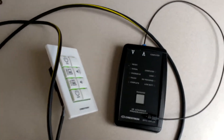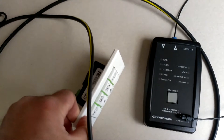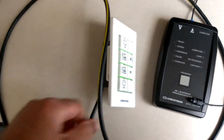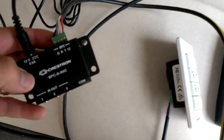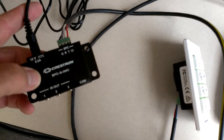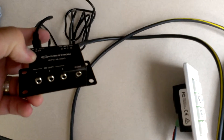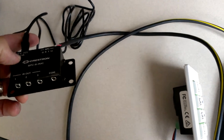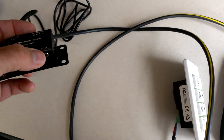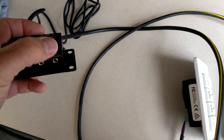Now for the final step of programming the BPC-8. We've got our keypad here. The only connection on it is Cresnet. It goes back to the BPC-8 IMC, which also takes in the 12-volt power from the wall wart. And then you have your 3.5-millimeter connections for 3 IR outs and the COM port. When we hook this thing up to the TV, we're going to have a 3.5-millimeter to DB9 coming out of this slot.